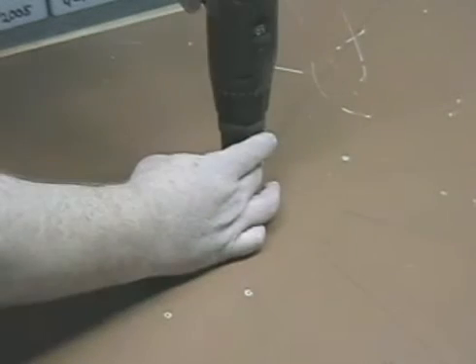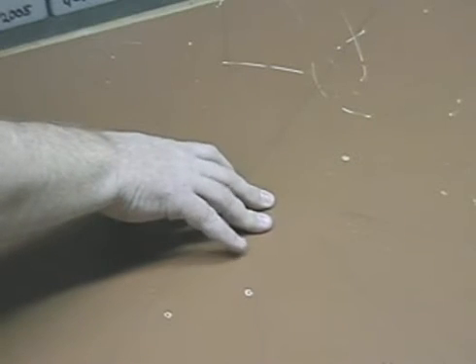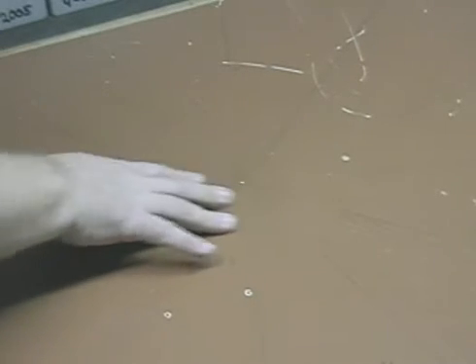What you do here is place it exactly on that point you created with that pin and hit it a few times. Now that drill will not walk out of that hole and your drill is centered perfectly, because the pin mark really isn't enough to allow the drill to drill perfectly unless you have center drills, which a lot of people don't have.